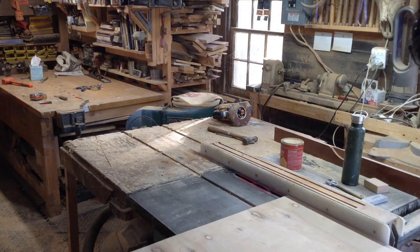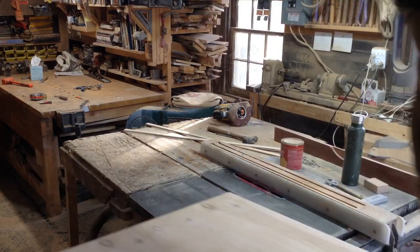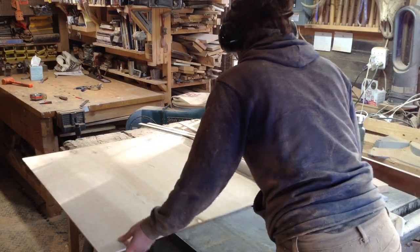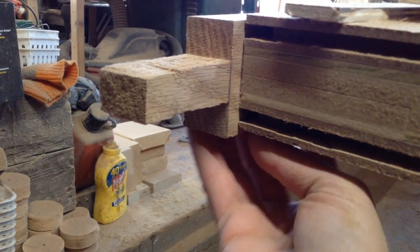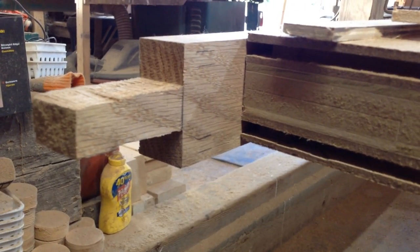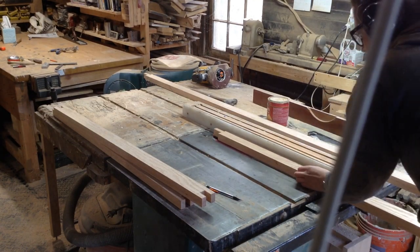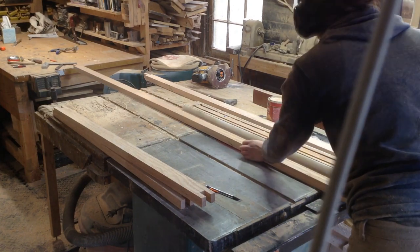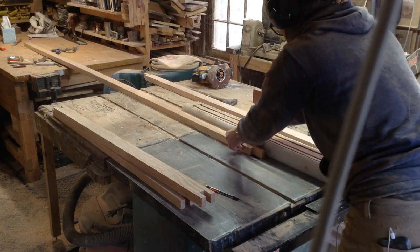For the strips going in those grooves, I'm just cutting quarter inch plywood that I had laying around the shop. I could align these and put that in place to mark where the grooves on all of my boards should be, then use a quarter inch dado stack in the table saw. I'm going to cut those grooves aligned with the marks, so I could do the top side on all four and then adjust the fence and do the bottom side as well.